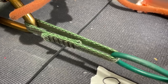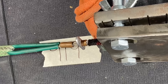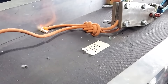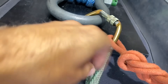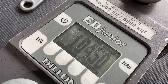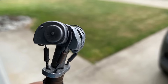Last but not least, we have a green Alien. This is everything I hoped Cam Crusher would be — holy cow! The sling is plenty strong, the wire is plenty strong — really awesome. We got 10.45 kilonewtons or 2,200 pounds of force. Bobby donated this one because he thought the sling might be bad. Look at that lobe — look how deformed it got right there.